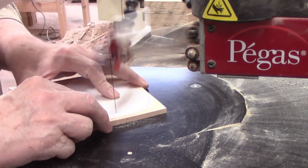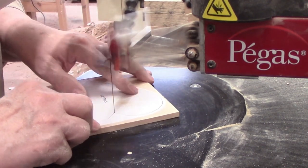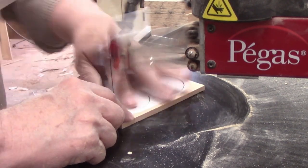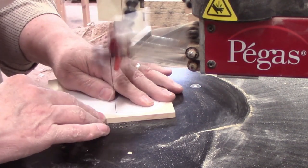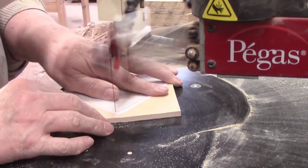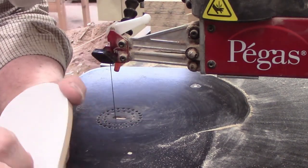You need to apply enough glue so the pattern doesn't start to peel off while you're cutting, but not too much or the pattern becomes a little difficult to remove. It looks like I was closer to the too much on these, so I'll have to use a sander to remove the parts of the pattern I couldn't quite peel off by hand.